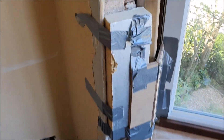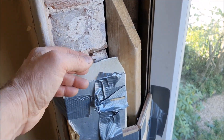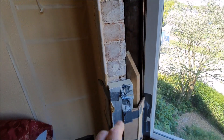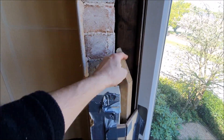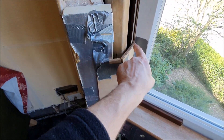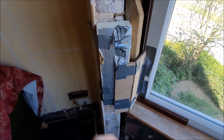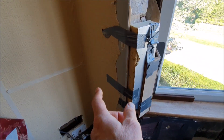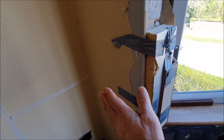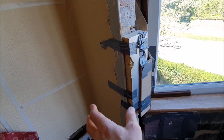So this is just a mock-up of the insulation I'm going to be putting in. I'm putting 50mm in here, plus I've taken the lath and plaster off and I'm going to be adding some structural wood in there so that I can use that to box — to fasten the boxing in. I've decided possibly something to go on the wall side here. I'm going to put some insulation in, but in front of that I'm thinking of match board. I'm not entirely sure yet, but match board in there.